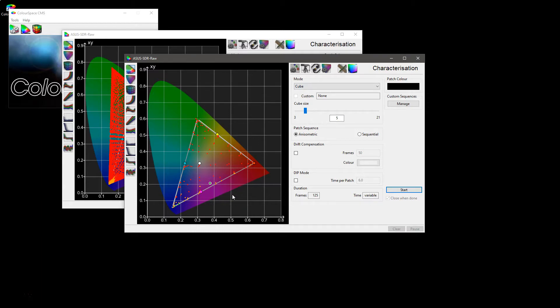To be fair, even when using ColourSpace's standard four color volumetric method, or any calibration software using any FCMM method, it is always better to rematch the probes after calibration if the gamut of the display changes dramatically from wide gamut to narrow gamut, as the differences can cause issues with probe matching. This is pretty much a standard procedure to follow if you really want to verify how accurate the final calibration really is.